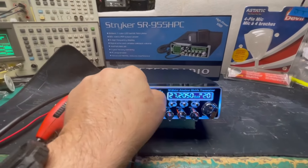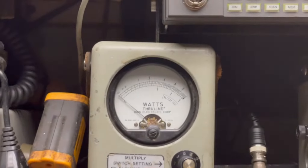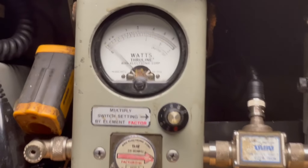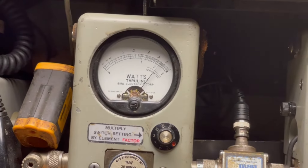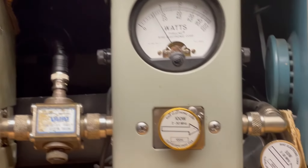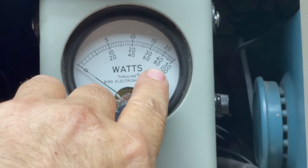Starting on AM with the power all the way down: 10 watts on the top scale, power all the way down is 2. Going to the next scale — 10, 20, 30 on the bottom. Turn the knob all the way to the right and we get 20 watts, and with that 100 watt peak power, right there.